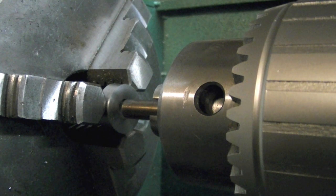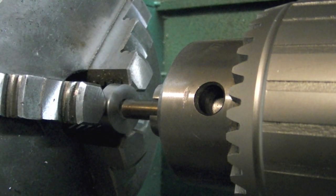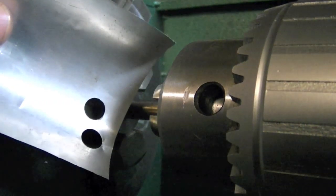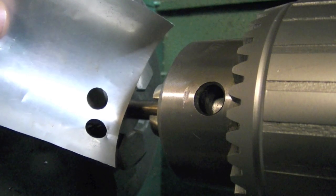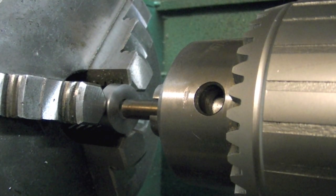For example, let's say you need a hole in a piece of shim stock — whether that shim stock be plastic, brass, or aluminum. Here I'm using an aluminum can. All you need to do is find a drill the size of the hole that you're trying to punch — in this case a letter size O — drill a hole in the piece of scrap, then flip the drill end-for-end in the chuck in the tailstock and use it as your punch. You can get surprisingly good results.